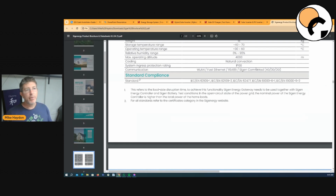And one of the things for us off-grid, buying and installing these products, is there's $2,000 to $3,000 extra expense to put them in all these big steel cabinets we've been doing. With this, I think the money is better spent on more battery storage. Instead of buying a steel cabinet just to enclose your stuff for your insurance, and I call these steel cabinets insurances. I've had systems over the years die from geckos and rats and mice getting inside and doing their business, which killed the inverters, and they're not covered under warranty or insurance. Well, you can get it through your home and contents insurance. But with this, they're IP rated. You don't have to buy that product, and it's more reliable because of the way it's designed. It's IP rated, which is great.